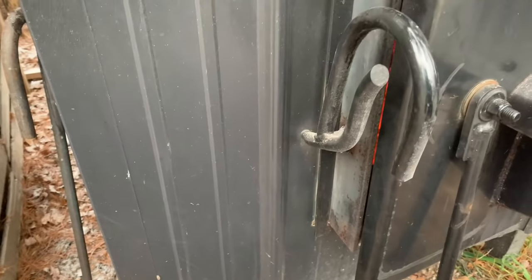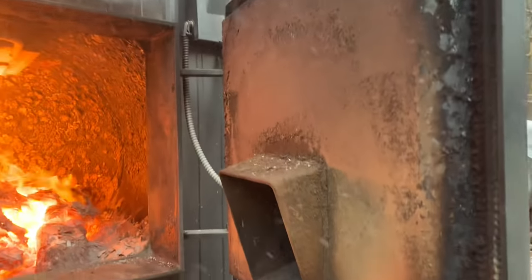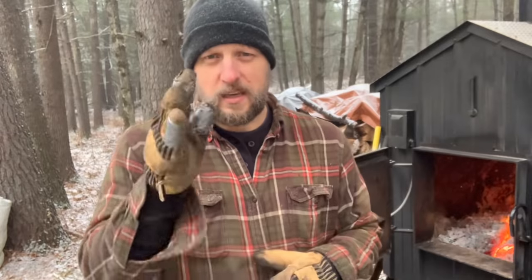Let's take a look — chimney looks nice and clean, nice dry door. This cardboard trick is the way to go if you want to burn off creosote. If you have excess creosote in there, chimney's clogged up, whatever the case is, use cardboard — it'll flash-burn it right up. Keep cardboard on hand; it's a nice easy tip.